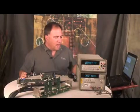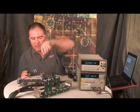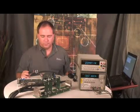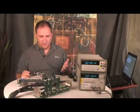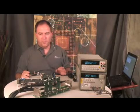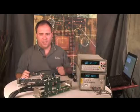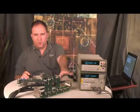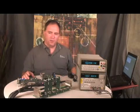Now that the high pressure calibration is fully complete, we're going to adjust the sensor back to low pressure and calibrate the output to 0.5 volts. It's going to measure the sensor, adjust, and calibrate. When this portion of the calibration is complete, the PGA308 will be fully calibrated. One last step will be to do a verification of the high pressure output, which should be 4.5 volts. At that point, we can then write the information into the EEPROM or into the OTP, as is the case for the PGA308, and program the module so it will be a standalone electronics module.